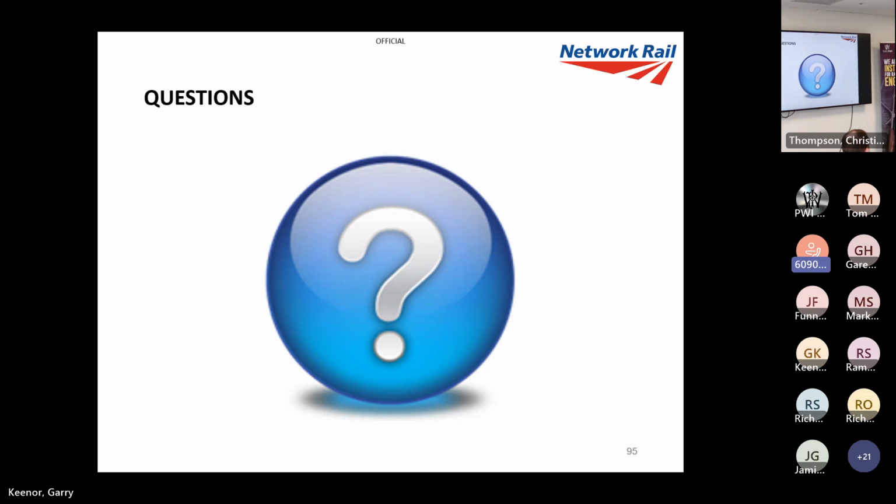So you've just got to be careful with what you said, though, as well. The 25 is for a single intervention. You see what I mean? So what we do in that situation is we've obviously got our stanchions 60 metres apart, 62, whatever they are, and we've got our mid-spans, so we know what they are there, but we will go to the overhead line engineer, say, at Swindon. And what we're doing is when we're at the high points, we're not lifting, we're only lifting the low points, because that's where the faults are.